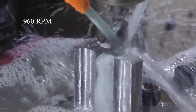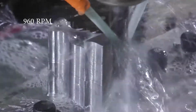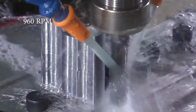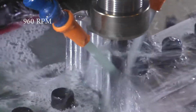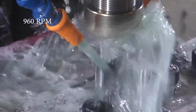That's a pretty good chip load. The RPM is much lower than I expected it should be to get rid of that chatter. The numbers from GWizard, for this cut I believe, were around 2125, which seems too fast now.